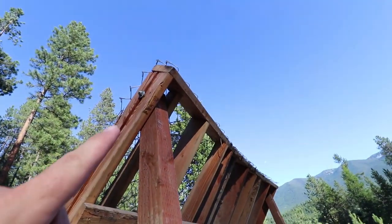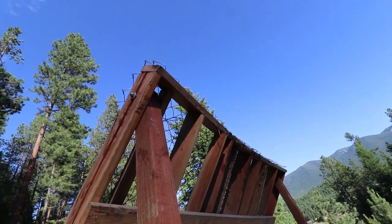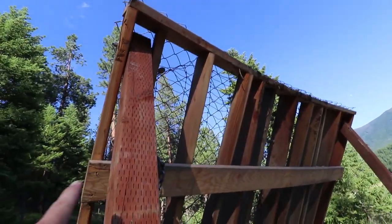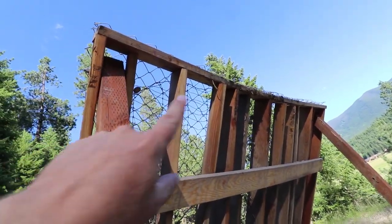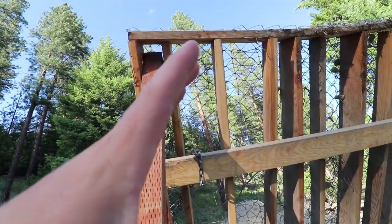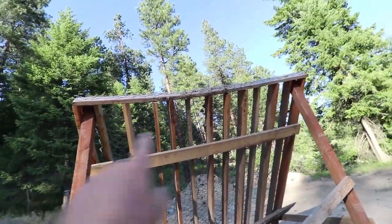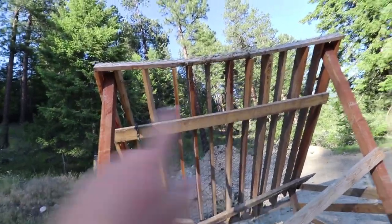This joist is broken. I'm going to give a little bit of thought to how to strengthen that upper corner up there. We may end up using something across here like a diagonal brace that will create some rigidity in here to resist racking on this. I think that may be what torqued this that way. And then also, doing something up here to brace along the top of these two to create some stability within the frame itself.